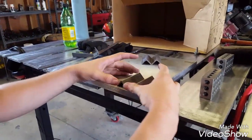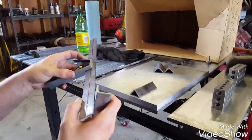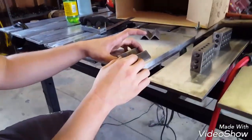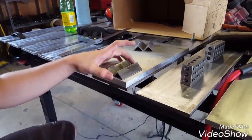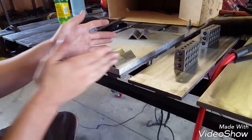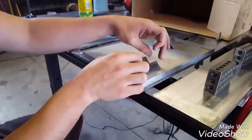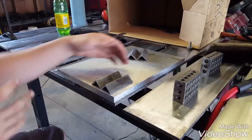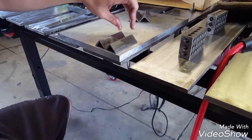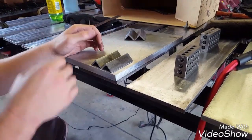What we're going to use is two sections of one-inch angle iron. The ones I have at work are made of aluminum and they're an inch and a half, but this will be fine for home. I have them about three inches long. Any less than that and when you put the pipe in there it'll kind of wander. Any more than that and if you get a vent tube, it's going to run up here and you're always needing to weld right where that is.